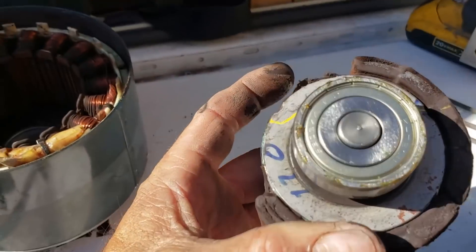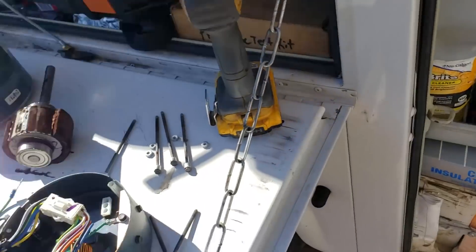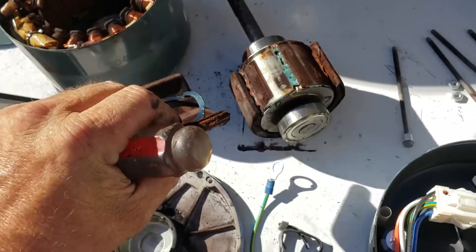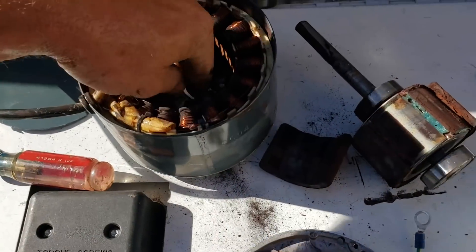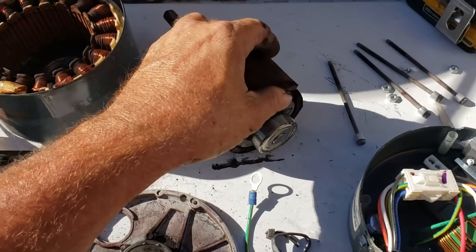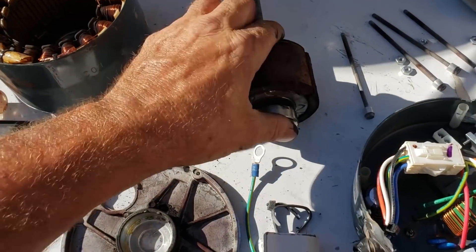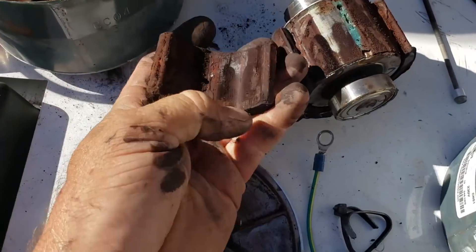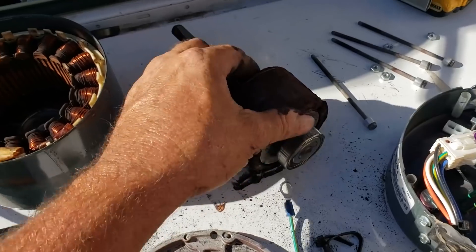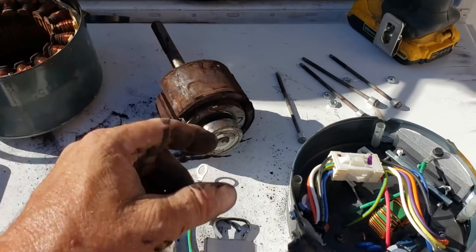Look at that — actually the magnets... did it break, or is that just sections? I think it's three sections. It's magnetic so it's grabbing on everything, including a little spring washer there. There's the magnet — wow, this is actually pretty light. So if that were to be bonded on, it would work again. This motor failed because the magnet came off the armature. Front bearing, back bearing — bearings are fine. Just the armature shot. I've never seen that before. That's a failure. So the module's probably good.